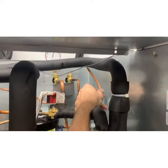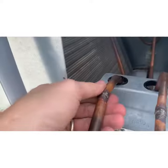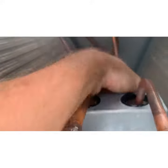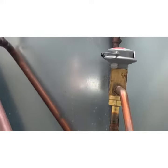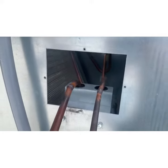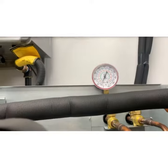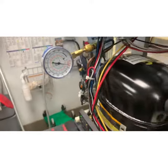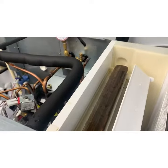We looked upstairs and I don't see any oil or evidence of a leak anywhere — nothing obvious for having lost its whole charge. So for leak detecting, because we have no pressure coming out at all, we're going to vacuum on the low side, which tells me the leak is on the high side.